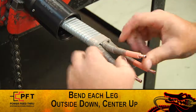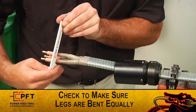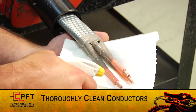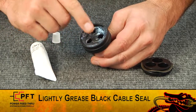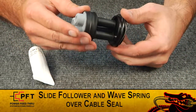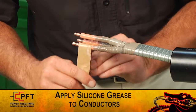The two outside conductors should be bent downward, the center one upwards. It's important that you do not stress or crack the lead or barrier. The legs need to be bent equally. You can check this by making sure that the lead cuts, insulation cuts, and conductor ends of each leg are all even with each other. Before proceeding any further, thoroughly clean each conductor. Take the black cable seal and lightly grease its face. Then insert the flat side of the gray secondary seal into the recess of the black cable seal. Now hold up the black and gray seal assembly and slide the follower with wave spring facing to the back over the three legs of the cable seal. Note the follower body on the high temperature HL kit contains two wave springs. Slightly spread the three conductors apart and apply a light coat of dielectric grease on each one.